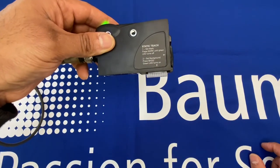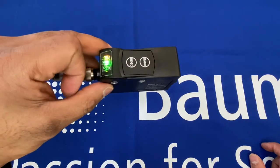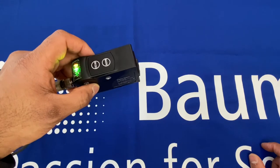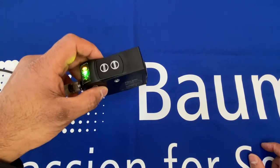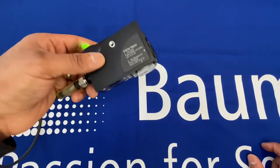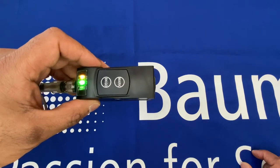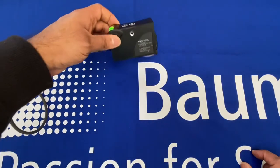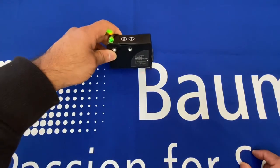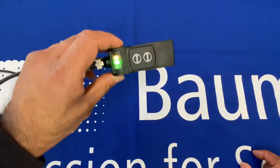Just set the mark and the background and you're ready to go. It has a standard response speed of 33 microseconds and an optional output delay of 20 milliseconds. It produces a beam spot of 5mm by 1.5mm at 9mm distance, with plus or minus 3mm tolerance from that distance. You also have the option to change to an 18mm lens for a bigger working distance and a nice sharp beam spot, which produces a vertical line.